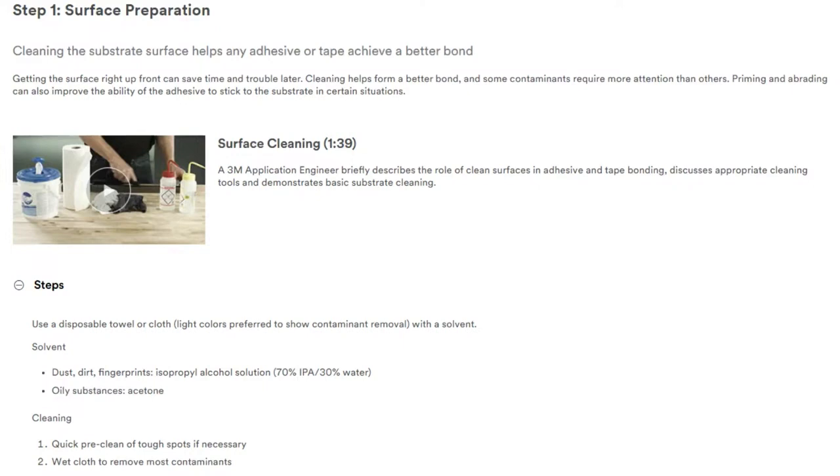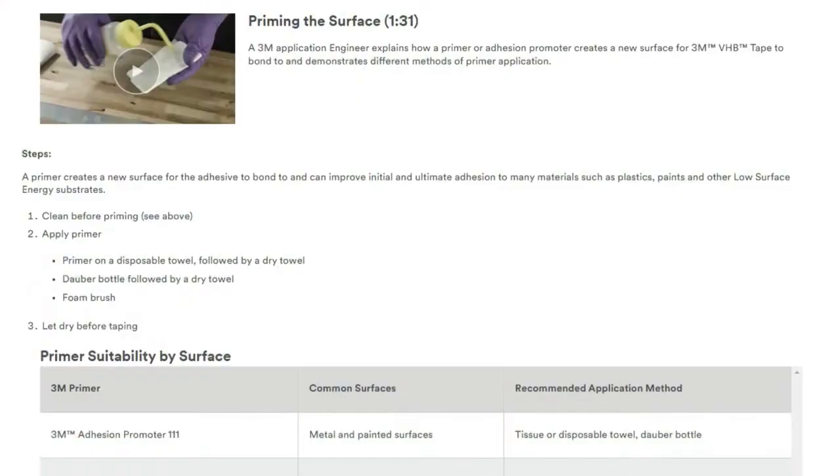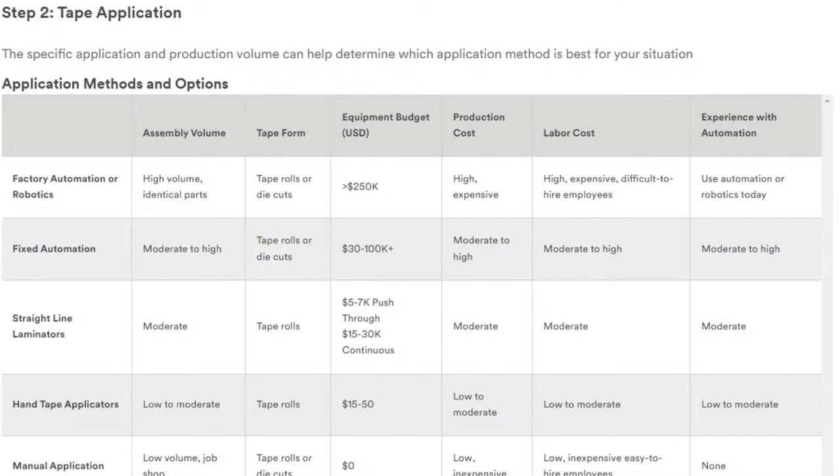You can also abrade the surface. Abrading, especially for smooth surfaces, will let the glue seep in a little bit better. It's not essential, but if you do it, you're going to get much better bonding grip at the end of the three-day curing cycle. Priming is another thing you can do — I think it's mainly for outdoor uses where you really want the best bond possible — but you can actually skip these steps if your surfaces are clean and you don't need it to stand up to automotive or industrial use cases. Then finally you apply it — either automatically using robotics or laminators, or manually by hand, cutting a piece of tape and putting it on.